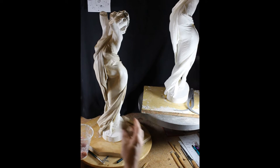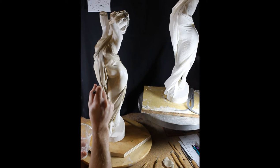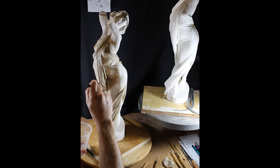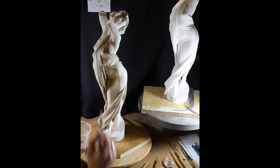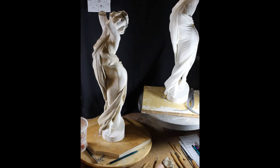And by the way, this clay gets very sticky. When you cut it with the lighter fluid, it's going to be very tacky, sticky, gummy, and you just roll with it. As you let this stuff evaporate, it will eventually evaporate. Your clay will become a little more rigid, resistant to the touch again, less tacky. And at that point, we're going to go ahead and put a layer of crystal clear on it. So we don't really need to worry about that anyway.